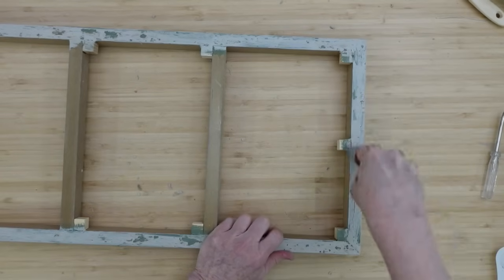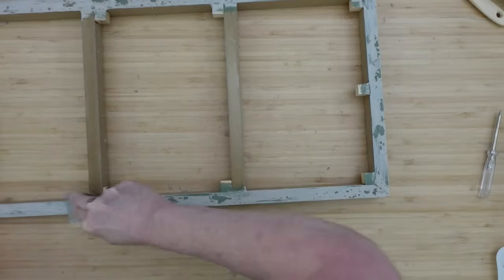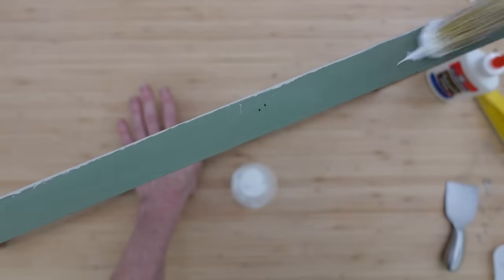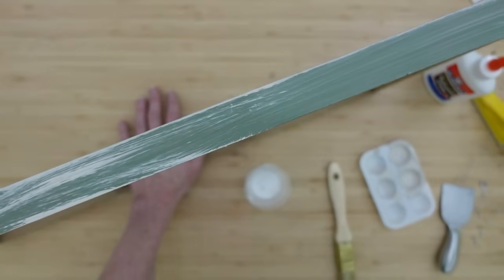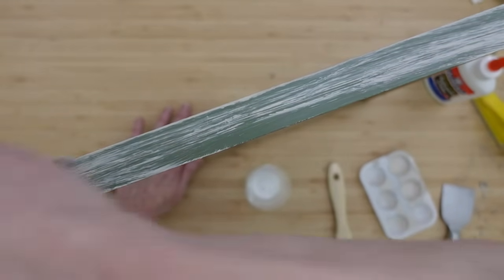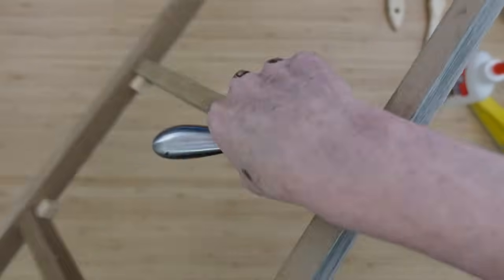You could also use a piece of wall decor over maybe a black paper — just use your imagination. We're also going to address the sides: add the glue, and before it even has a chance to dry use a chippy brush to streak some on there. I went a lot lighter with a larger chippy brush and it did the exact same thing as before, so we're going to go back and do the same thing — go over it with my little knife and scratch it up, take the bubbles off, sand a little bit, get that awl, drag some lines through it. Make it look like this frame has been around for a hundred-plus years. Then I'm going to go over all of that edging and bite through all of the paint back down to the bottom.